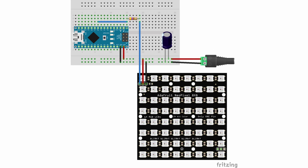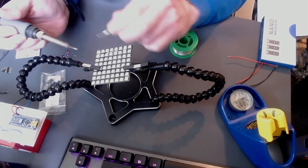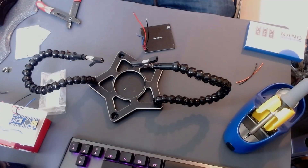I've gone for a recommended layout with a capacitor in bypass to stop the power supply from shorting out the RGB matrix and to help prevent any light flicker. If you want to build the flag light without a power supply, I've also included an alternate circuit in the repository, which essentially moves the capacitor between your microcontroller and the matrix and uses the 5V out of the Nano rather than the voltage-in pin. It's always a good idea with a circuit like this to first breadboard it up to make sure everything is working before you commit to soldering. With the matrix there are limited options for connecting it up, so what I've done initially is soldered on jumper wires so I can test out the circuit.